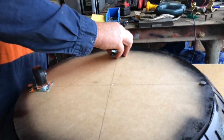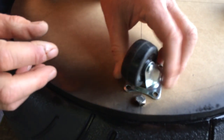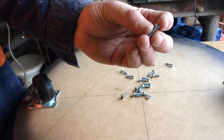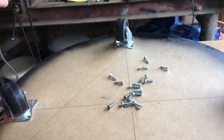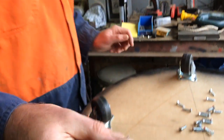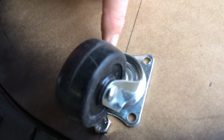Now I'm going to attach my wheels, and I'm going to place them about where my cross marks were so they're about the same distance apart. These screws are just small self-tapping countersunk screws — you don't necessarily need countersunk screws, it's just what I had in my shed. You can use something with a flat head, which is probably good. Whatever you've got — if you need to buy something, only get something fairly short because you don't want it poking through inside. Your screw size is going to be dependent on how big your casters are and what the holes are.